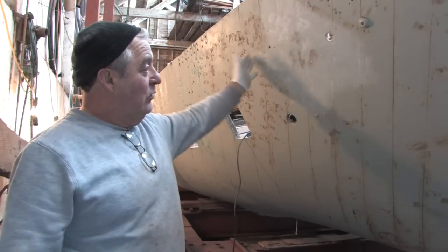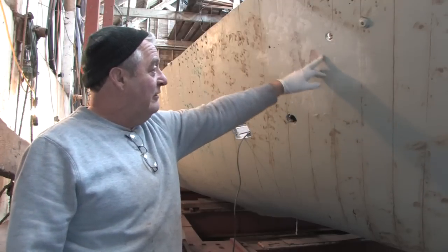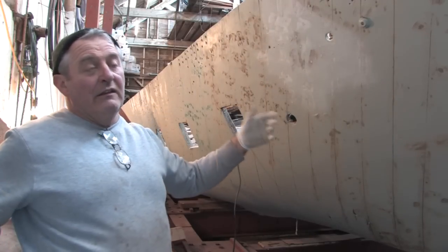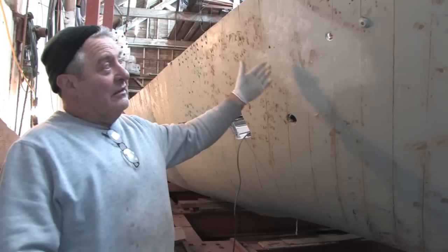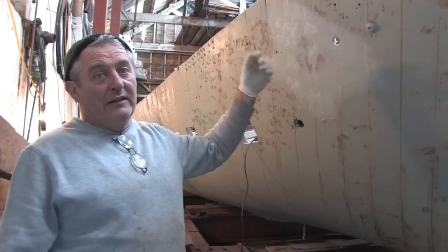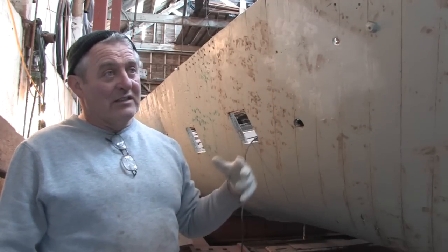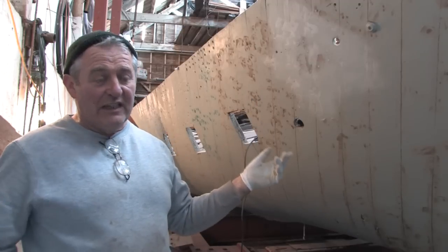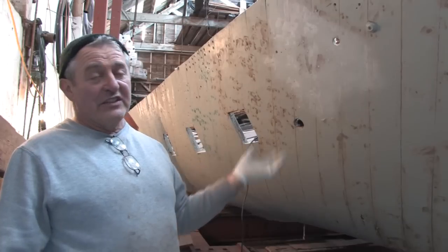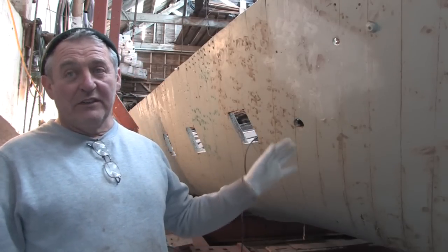So the whole boat will be filled, sanded right down. A second filler will go on. The whole boat will be sanded again with another flash coat. Then that will be sanded off just by hand and then there's two primer coats going on and then about four undercoats to go on. When we were last busy we were progressing with the planking on the other side. We haven't yet turned it over but we have got the other side complete. So if you want to go around now we'll have a look at a completed side of the boat.